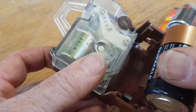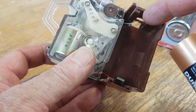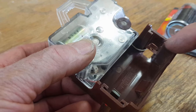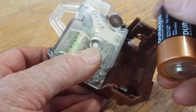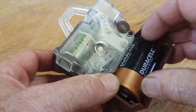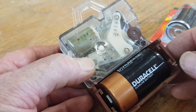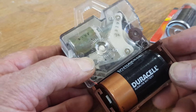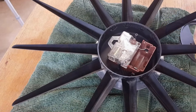I've had to spread the terminals in a bit and bend them a bit further. It possibly might have been worth my while to put a spring at one end, but this one didn't have a spring from original - it just had the two tabs, and I've bent them out a fair bit so they have a bit of spring anyway. The battery now will go in and hold firm. It's also worthwhile - if you're pulling apart transistor radios and things that aren't worth fixing, or remote controls and TVs - to grab the little springs and connectors and put them in a tub. It's a very common problem and it's worthwhile having a tub full of various metal tabs and springs for repairing future jobs.